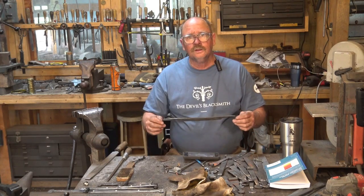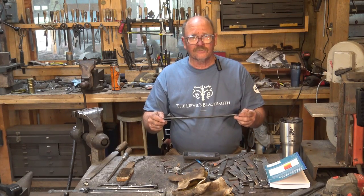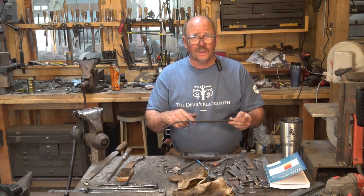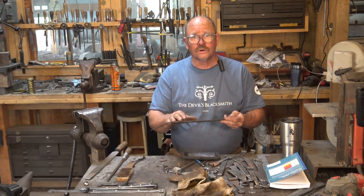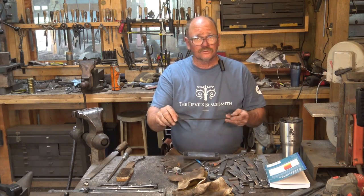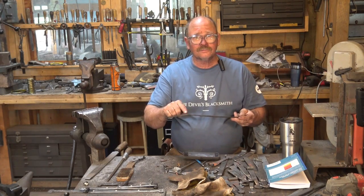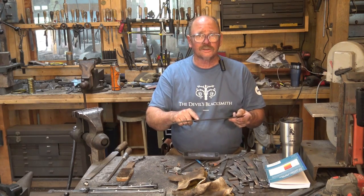Sorry about that. So what other issues might you have hardening and tempering? Well, obviously fitting this in things. If you have a gas forge with a back door, it might be too wide with the handles. Leave the handle straight when you harden and temper it, and just don't let the heat from the torch, when you bend these, bleed into the blade, and you'll be just fine.